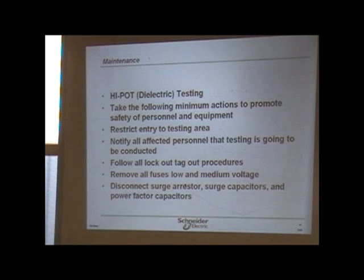And those are the ones where the guys would reclose two or three times and actually get hurt and even killed trying to reclose. So for those fuses to blow, everything was perfect. That's sort of that triangle I was talking about. Everything started adding up, and then got right up to it, and bingo, there's when the accident happened. All that was already on its way, and all it took was that one little ground to come there, and it took it all out.